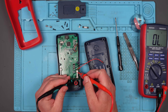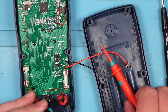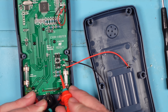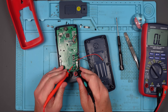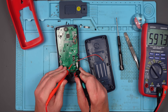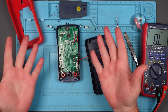So I flip it back around and start looking at a couple of resistors near those diodes — that's where we'll pick it up. Going from the input, on these two resistors we're getting continuity on that side but not on that one. On this one we're getting continuity on both sides — it might be a zero-ohm resistor. Let's check it on ohms. This one wasn't getting continuity through, and that one is 100 ohms. So what's this one? 2 ohms? I need to take it apart again.